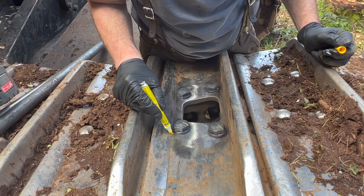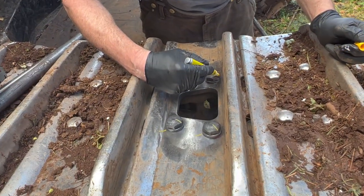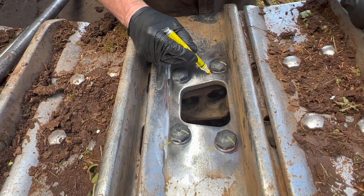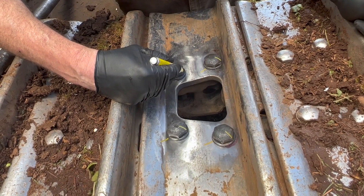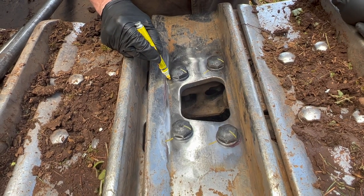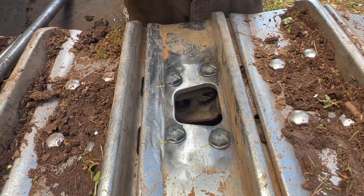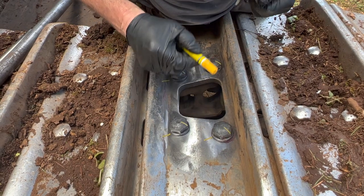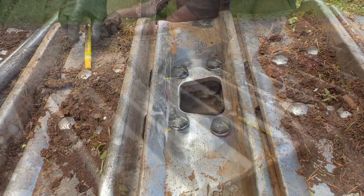This is something I also use that worked really well - it's super simple. It's a six-headed bolt, so if you draw an imaginary line across the top of the bolt from point to point, that's splitting it into thirds. I mark one of those points and then use that other line to mark it on the pad itself for what's going to be a third of a turn. So you can get on it and bring it home.